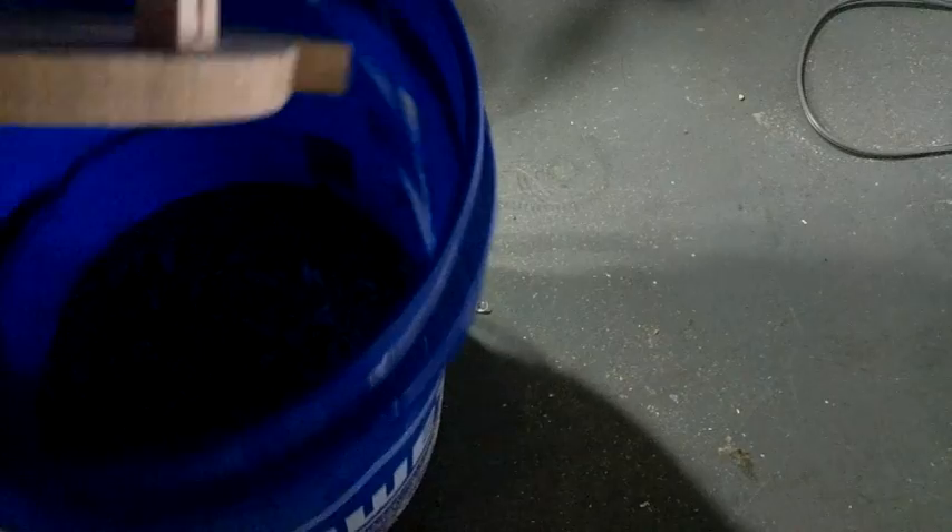But this is what we got — this is my preliminary test. It's fine sawdust that clogs up your shop vac filter, from my understanding. If we look in here, a little bit of it came back through — those are probably tolerance problems on my end, and they're mostly big ones so I don't really care. I can always blow it out with the air compressor. But if we look at what the collector actually got, you'll see it got the fine particles as well, which was a big concern. If we went in slower it probably wouldn't have been a problem, but I just stuck it in a big pile so that might be why it went through. Maybe I'll lift the intake up a little bit higher — I believe the design calls for three inches.